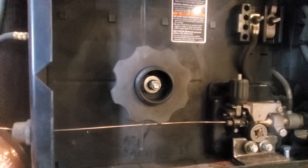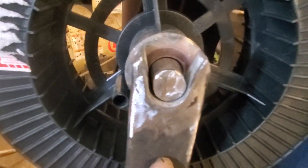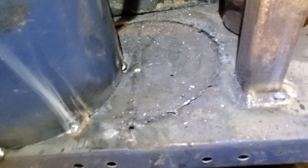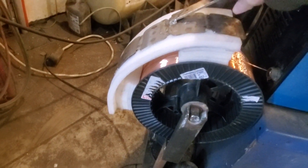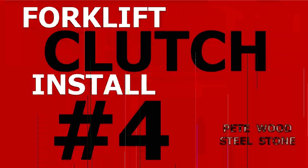So here's what I've done to get a 33-pound spool of wire to work on my Miller that only has room for a 10-pound spool: I built a stand, the spool gets plopped into these pockets, this foam is acting like a brake. I had to blow a new hole through the back, semi-centralized my tank — the tank used to sit there so it was in the way of the forky thing up here, so I moved it over. Then we got this foam brake that hunkers down on there, gives it some drag, holds the wire from coming off. For now it seems to be working — we'll call that good.